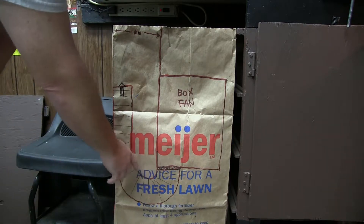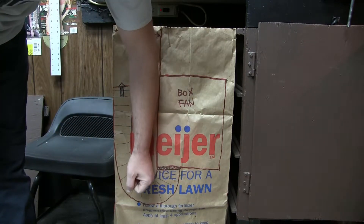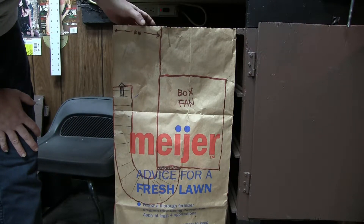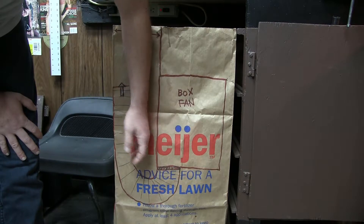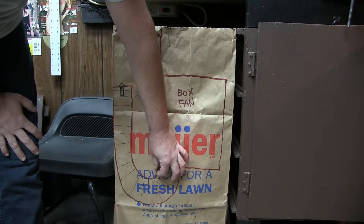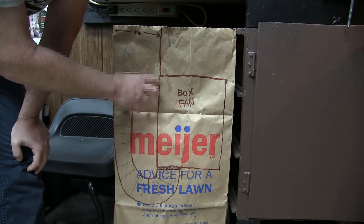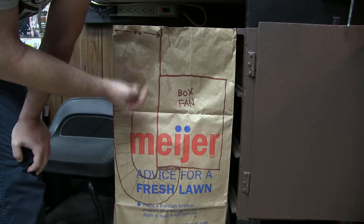The tube — my first thought was I'm working between two walls, sliding my arm down in between them. I've only got six inches of width and three inches of depth, a very small area with no visibility — everything has to be done by feel. I stuck my arm down there, found a hose clamp, and could get it loosened by hand. My plan was to cut the tubing there, pull it up, put a coupler on it, extend the three-inch up, use a 3-to-4-inch adapter, and run four-inch insulated duct up to the roof vent.